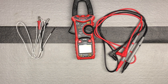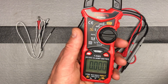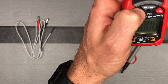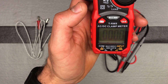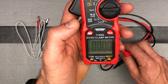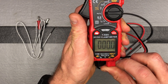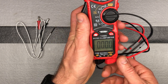You can go to Hz percentage, which is your frequency or duty cycle measurements. Hit the ZF until you get to that percent key and then you can measure that. To do so, attach your probes — the black goes to COM and the red goes to the input when measuring frequency or duty cycle.